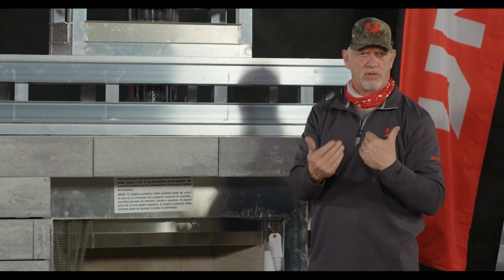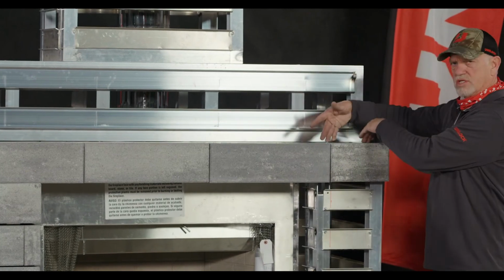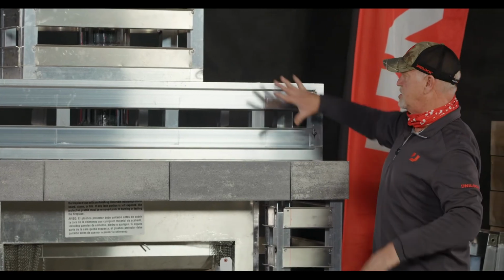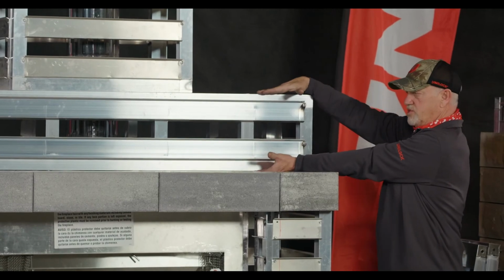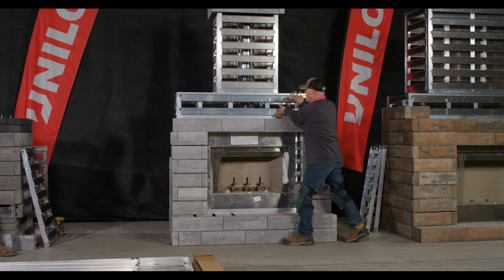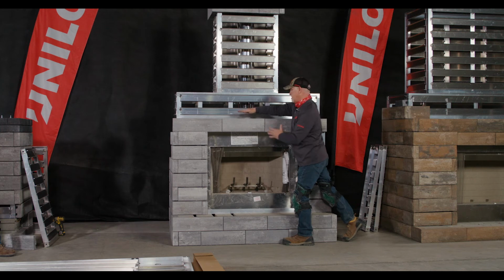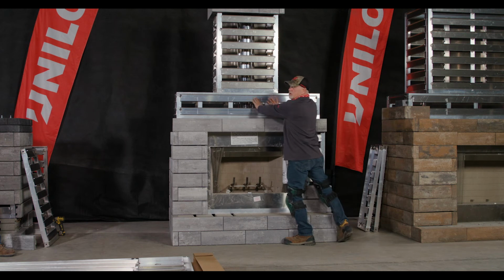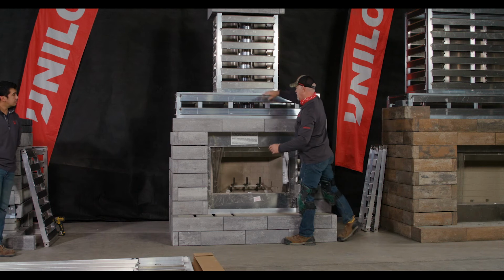So we've kind of addressed some of those challenges that might prevail on your job ahead of time here with development of the cabinet system. A couple other things that make this nice is the mantelpiece here. The mantelpiece, this front structure, they're going to be 12 inches, and you're going to have more tube steel here. So in other words, this is a more structural component across here. I can build my mantle in front of that here, and the homeowner can personalize that, but this now becomes a structural component that is going to support the chimney that you're going to construct.